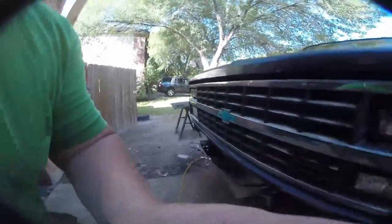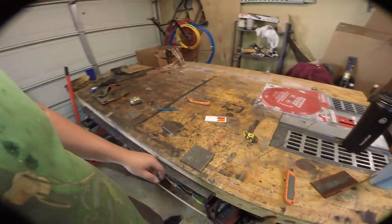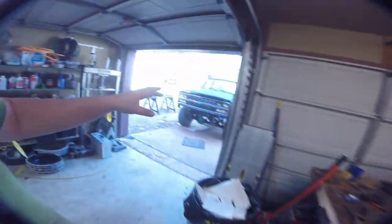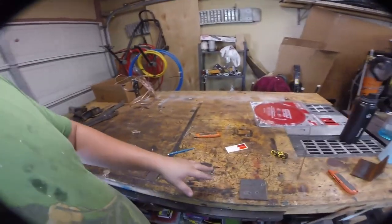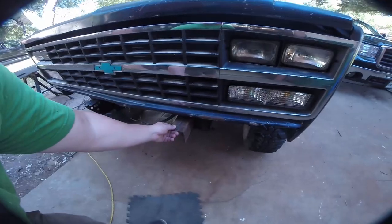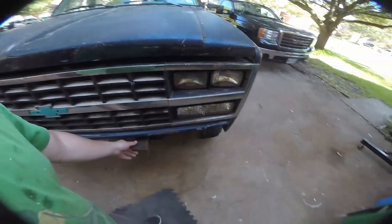After much thinking I've come up with a design and I'll flesh it out as we go. First thing I did was come in with an angle grinder and cut these frame horn ends down — mine are all bent and deformed from a life of hard use, so I cut them off to give myself a smoother surface to work with. We then cut out these 4x4 quarter-inch plates and 1.5 or 2x4 quarter-inch plates to build bolt-on mounts to replace the stock pieces. The stock pieces are probably 1/8-inch thick so we're doubling our thickness, but these are flat so the bumper will face level relative to the earth rather than to the truck.